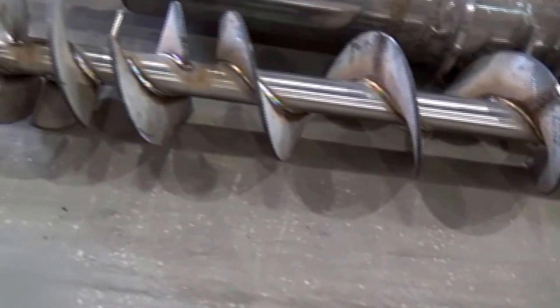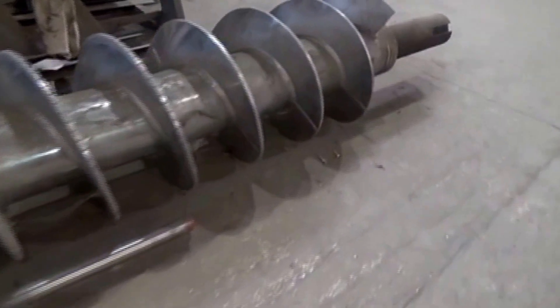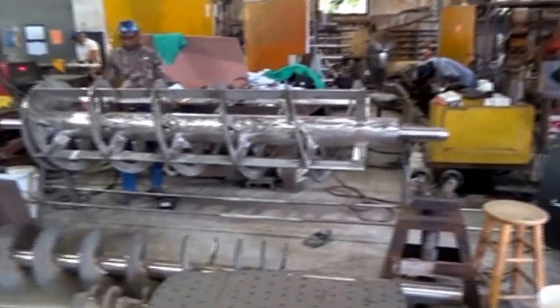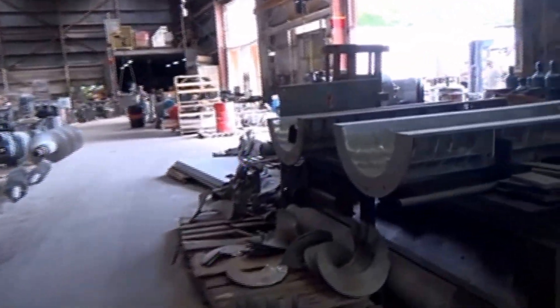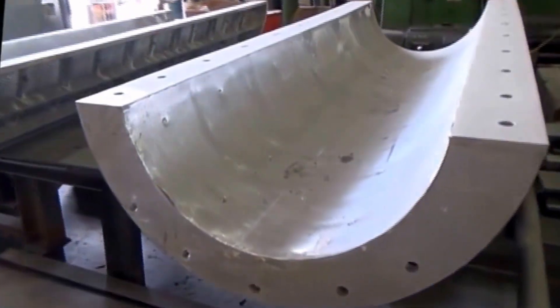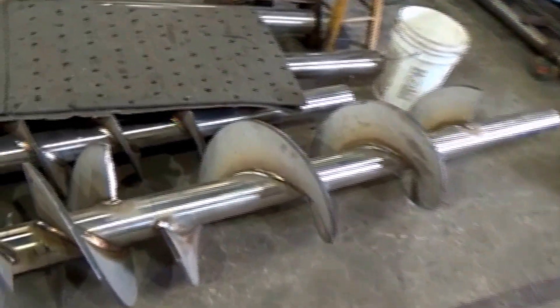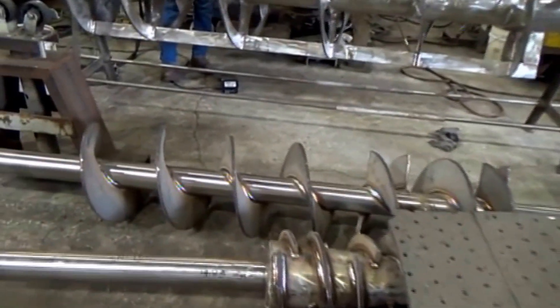Okay, on the way to the lab — a standard screw with cylindrical axial shaft, and here we have a larger one. Notice what we do to the shaft diameter: we increase the shaft diameter, which gives additional squeezing. You should recognize this part — it's the rotor for a fiber filter, just a little bigger than the six-inch model we've been using. We were working with perforated screen; here is a perforated screen, these holes are larger but maybe a millimeter at most — double what we were using. Here are a couple more screws with cylindrical shafts, and right next to them here's one with a conical shaft followed by one with a cylindrical shaft.